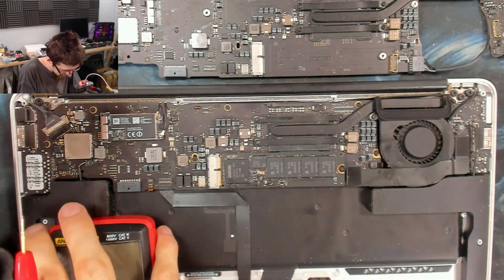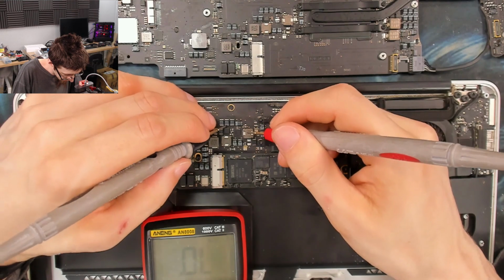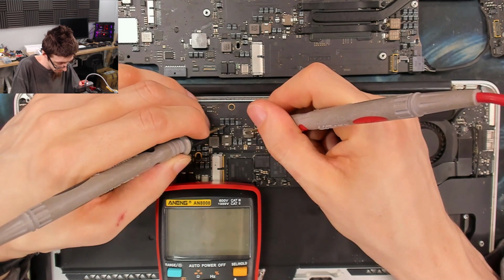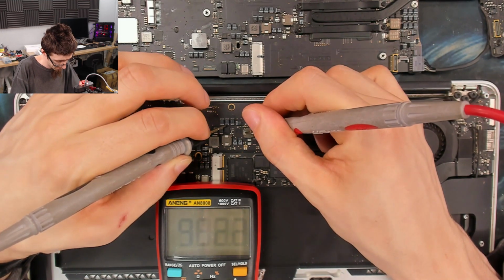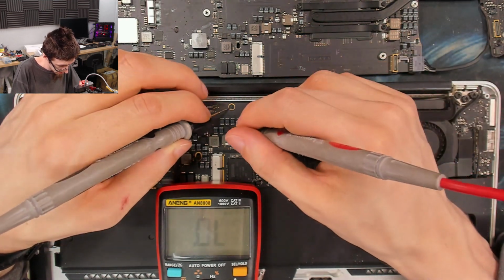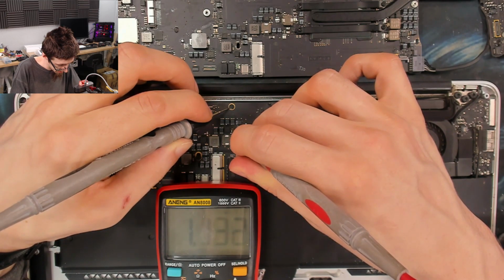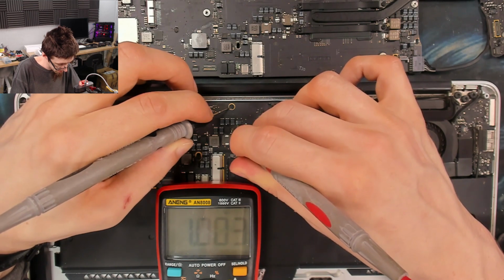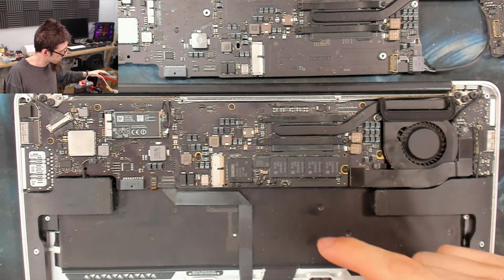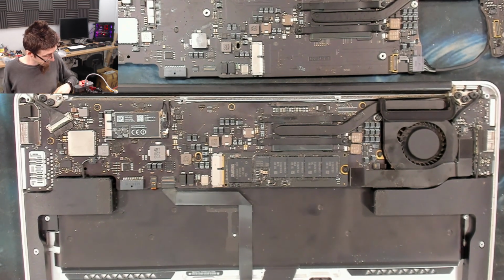Alright, I've got a breaker laptop here that has a board that is an absolute state. Let's check if this one is any good. So we'll check resistance through the same MOSFET, which is high, and PP-Bus G3 hot on this guy also looks pretty good. Cool. Let's see if this one works. It's worth a try. It's as good as any, to be honest.